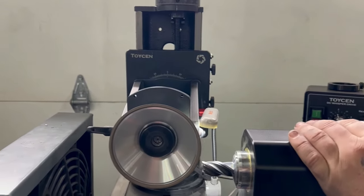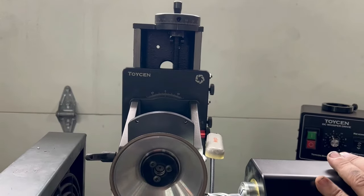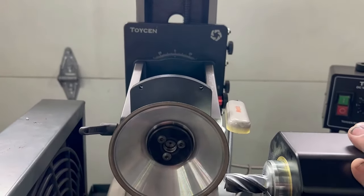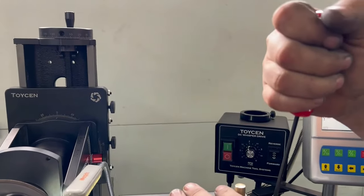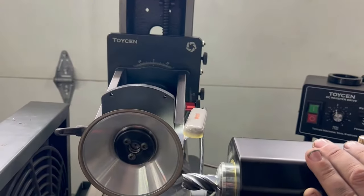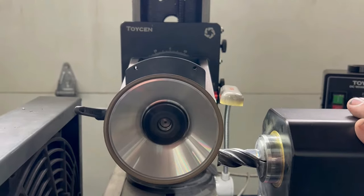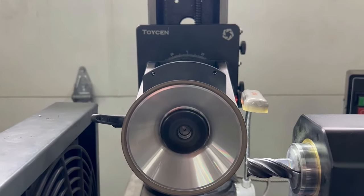You have to pick up the other flute independently as well, because flutes two and four are not 90 degrees to flutes one and three. Same process: set the display, put the wheel on center, bring the tool in, rotate to your touch, lock up the indexing collar, back away in X, back away in Y to 365, and now just plunge in about 20 thou. You don't want to come across center.